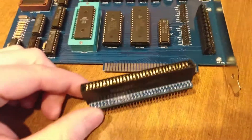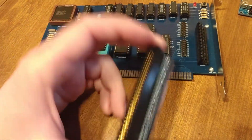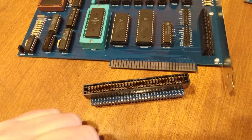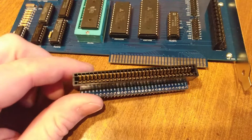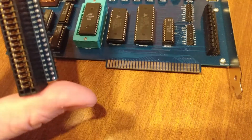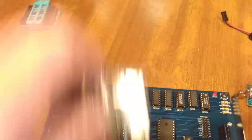This is what I use for prototyping — it's an ISA adapter that plugs right into a breadboard. The pins are all labeled. This allows you to plug right into a breadboard and work on your projects off of it. One thing to remember: you're working right with the system bus and the system address bus — these are not buffered, so you'd have to add buffers. All the DMA lines are there. Your interrupt pins are there, minus IRQ0 and IRQ1, because zero is the timer and one is the keyboard. But it's fully there — eight bit. So I'll plug that in over here. This is my prototyping board. Plugged in — now we'll go on to the additional parts I've made.